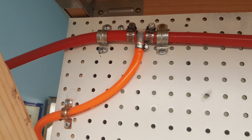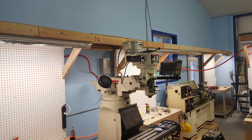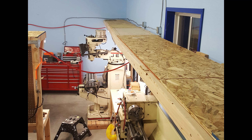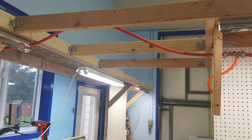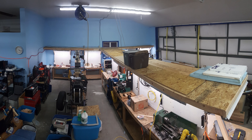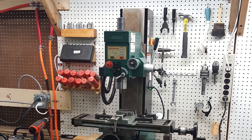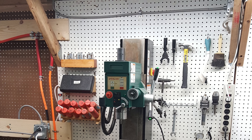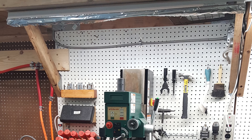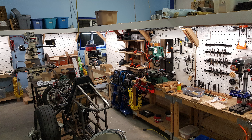I started plumbing the whole shop up with airlines with a drop about every 8 feet. I connected the benches to the walls and then connected the benches to each other at the top, filling in any gaps between benches with 2x4s. I put OSB and scrap plywood across the top of all the benches connecting them all together and adding plenty of storage space up top. Each bench got its own 4-foot fluorescent or LED light fixture, and each got its own pair of power strips. I added some white trim across the top connecting all the benches together to give things a cleaner, more consistent look.